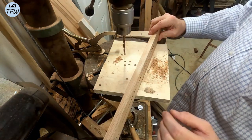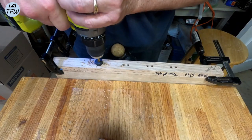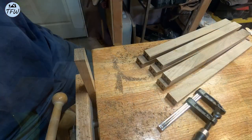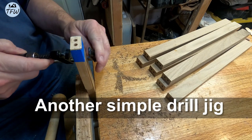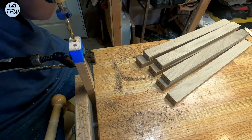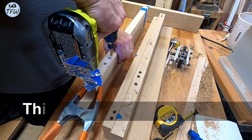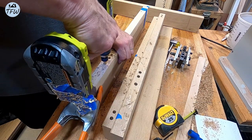This particular template will be for the back slats or the vertical staves between each leg. Setting it up on the oak stock, it makes it easy to drill those out. I've got another small jig to evenly space out the holes for each one of the staves, and again the jig helps with straight drilling down into the stock. And one more jig to help me lay out those major frame pieces between the two legs.